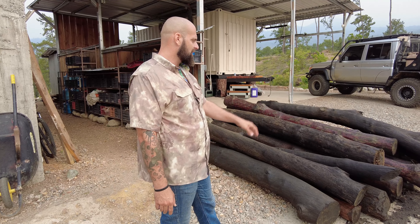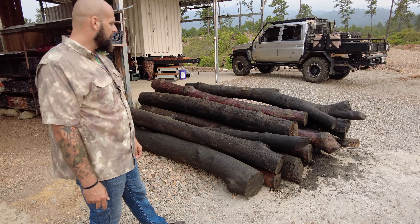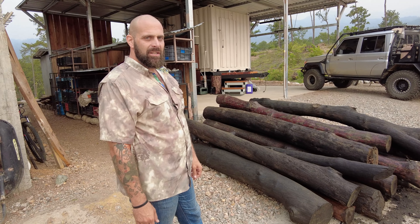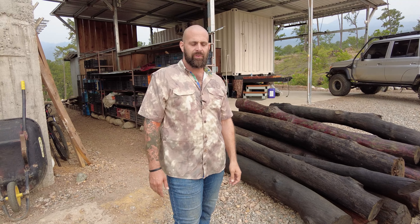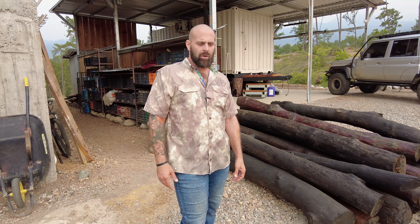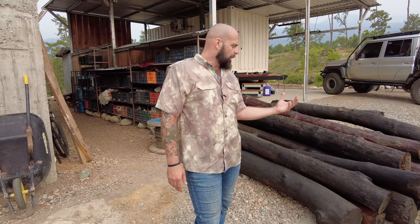I would say that this Caribbean pine is almost like a Douglas fir, which was used in the United States for so many years to create fence posts. It's probably twice as rot resistant as what you get off a tree farm. But from there, what you want to look at is you have to treat the wood so that it lasts longer. What they do to treat telephone poles, for example, is they put the wood in a vacuum chamber and use whatever mix of chemicals, then hit that vacuum and the wood naturally sucks all the material into it. But if you don't have a vacuum chamber, what we did with some of these is we dug a big hole, created like a swimming pool, topped it off with plastic.